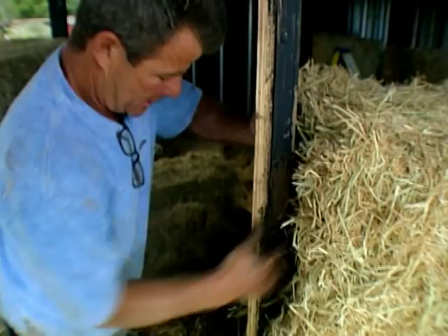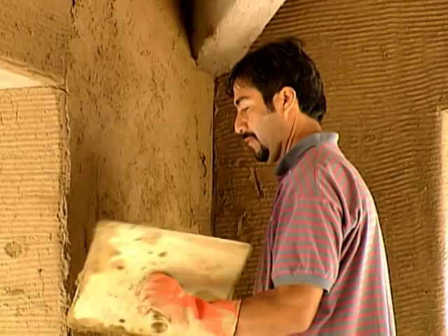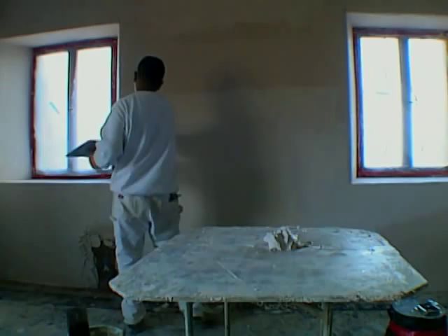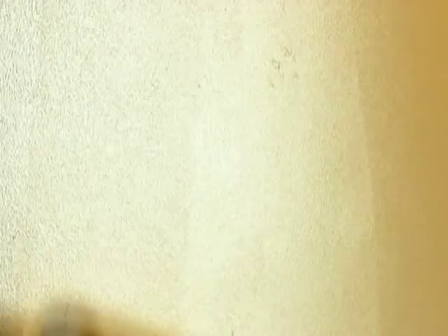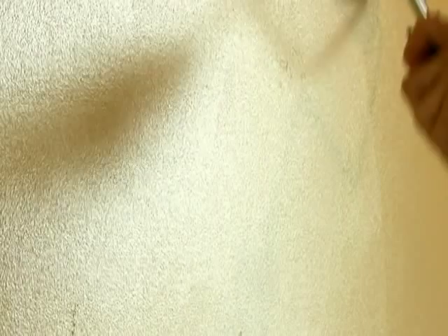In the last show, we covered the interior surfaces of all the walls — straw and framed — with the most natural materials possible. On the bales, we put two coats of earthen plaster, a mixture of clay, sands, ground straw, and water. Then we finished those and the interior walls with natural pigment-colored gypsum plaster. The result is an interior that is beautiful and permeable to allow the straw bales to breathe and maintain our health. We also painted our garage and laundry room using non-toxic paints that are safer and do not harm the environment.